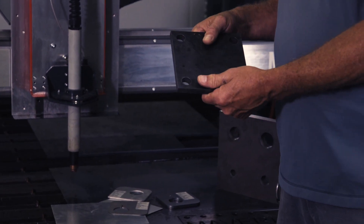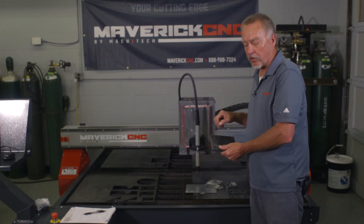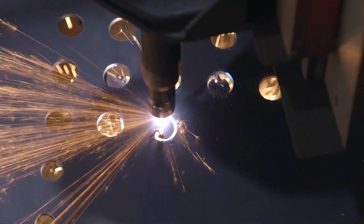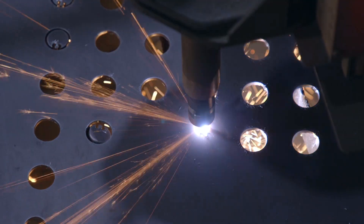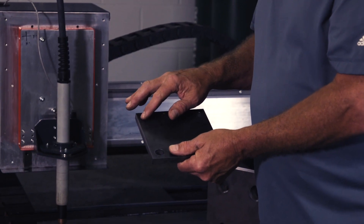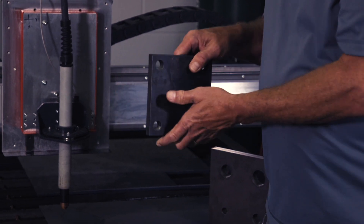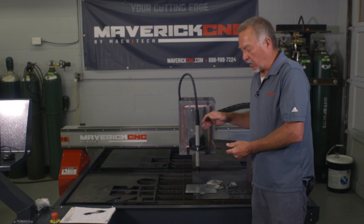At the end of the cut, it's very critical to have the proper kind of finish. You can't just shut the arc off, and you can't just go back into the scrap material. What you basically have to do is a little bit of an overburn — you actually cut past where the lead-in kerf was, staying at the cut height. It kind of planes off the end of the cut so there's no noticeable starting point on the front of the cut, and the bottom of the cut is round. It doesn't allow the arc to wobble on the bottom.